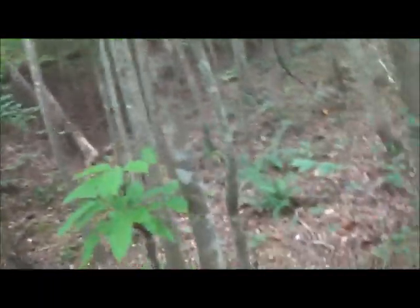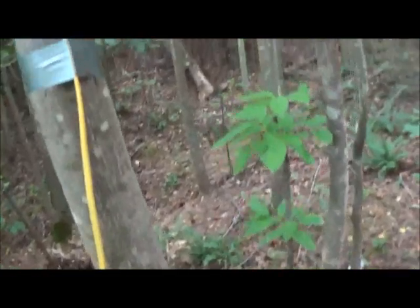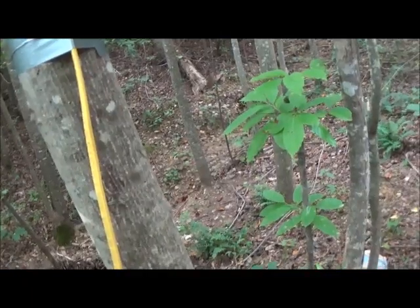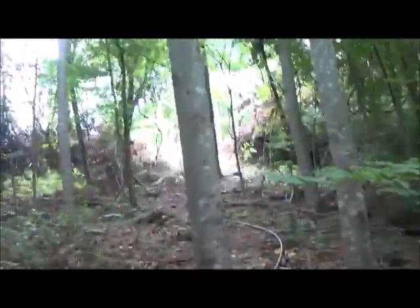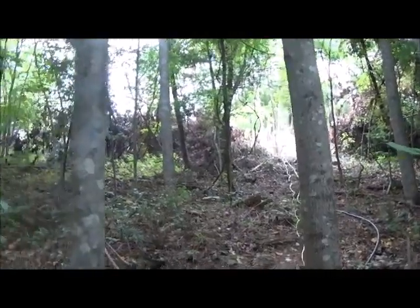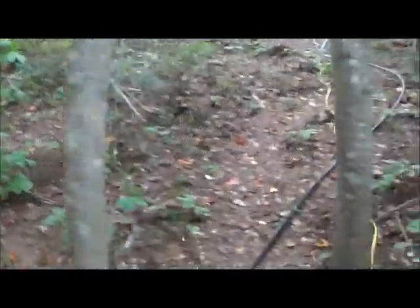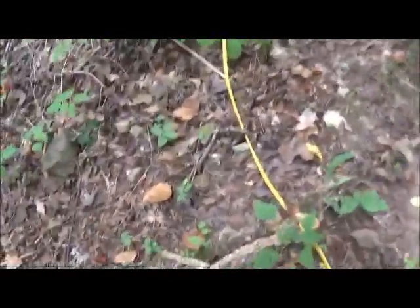Got some temporary power and water - some GFIs and exterior boxes. I didn't bother with UF wire, just regular, since this is only maybe three weeks or something. I'll have to be pulling these lines back for the dozing. So it's more of just emergency temporary use - I'm not going to be using UF wire throughout the place.